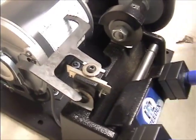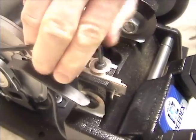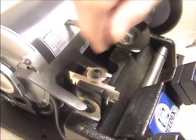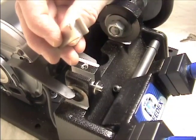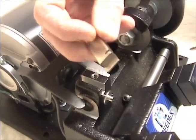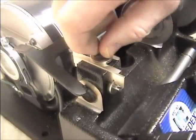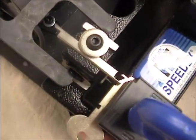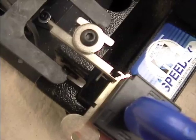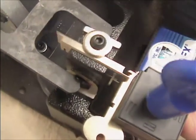There are several options available for the Premier Speedex machine. The machine is equipped with a double-sided tracer. One side matches the angle of the standard cutter. The second side is straight to accurately trace the straight cuts found on flat steel keys. With the optional slotting cutter kit, number CW16, you can duplicate safe deposit box and mailbox keys.